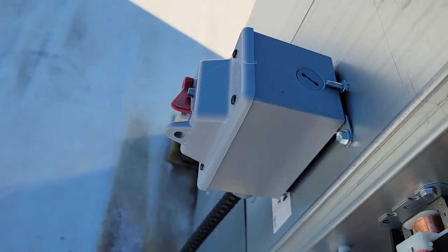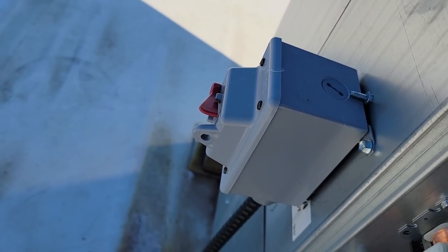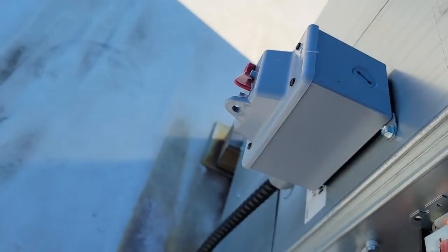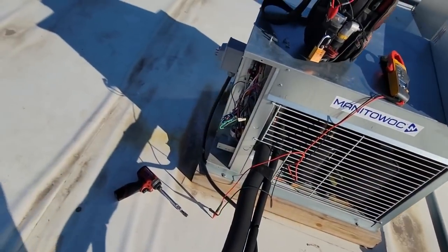So we've got a little disconnect switch there, and yet we've got power on one leg. It makes me wonder if we've got a breaker that didn't completely reset, or exactly what. Double-check here — yes, it's 200-and-some volts is what it's rated for. We're missing one leg.